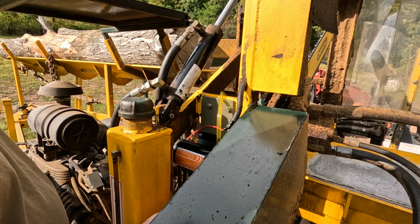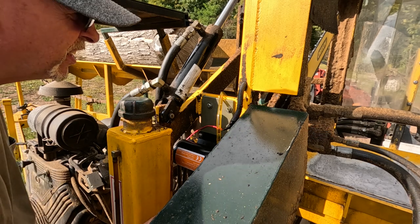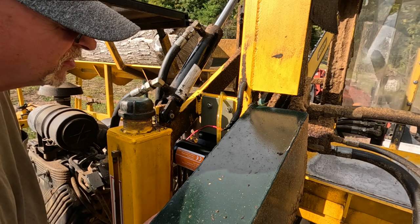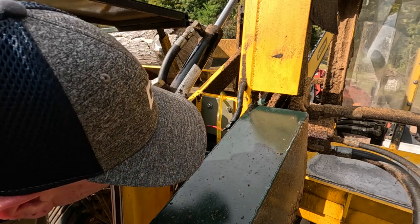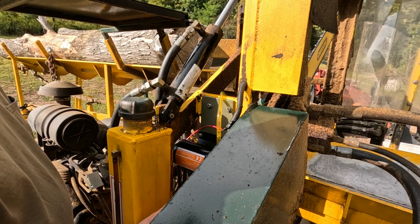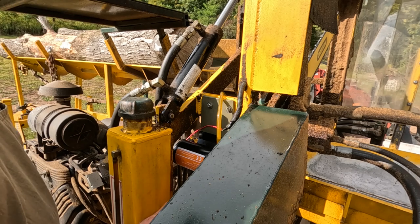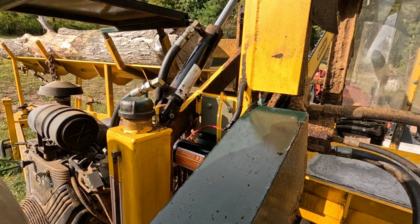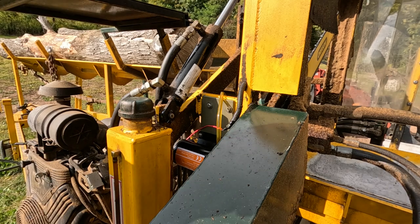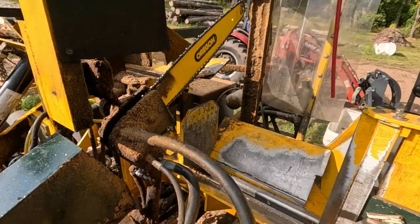The control valve is completely closed. Now I'm going to turn the key on and it's going to start pumping oil. Open this just a little bit. That's pumping oil. So we're going to give that a try and we're probably going to have to do some tweaking, but I sincerely hope that does exactly what I need, which is to give me the right amount of oil onto the bar.